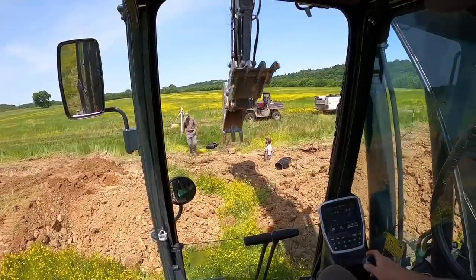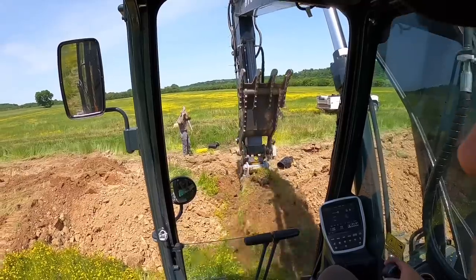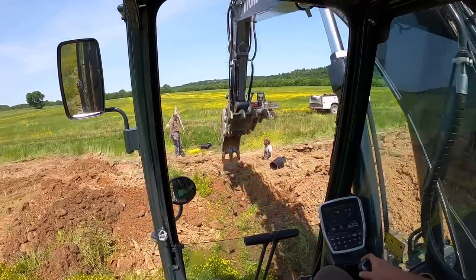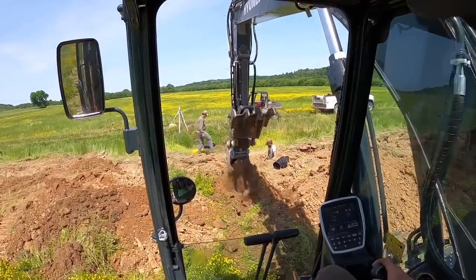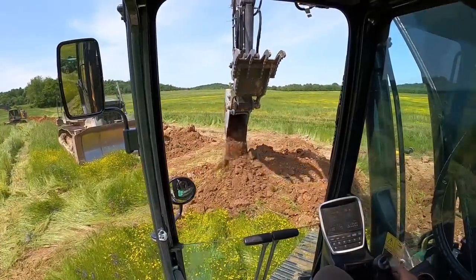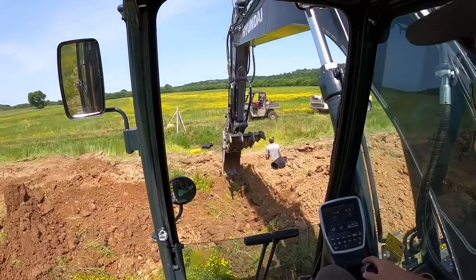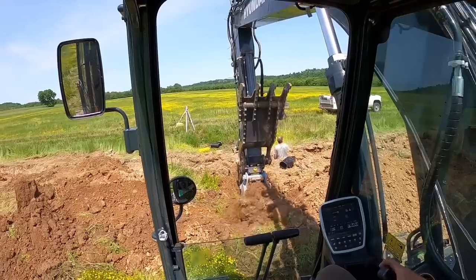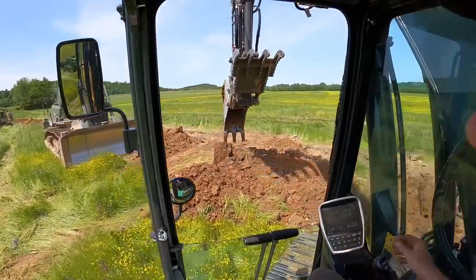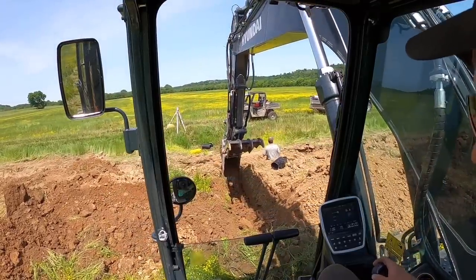We are officially done digging the mainline. I'm a little bit sad because I don't get to play on the new excavator anymore, but I'm ready to get some footage in the ground and switch back over to the plow. This has been a good reminder of how we did it old school. The plow is definitely faster — if we're 4 feet deep or less, what we can do in about 15 minutes would take us about 4 hours before. A lot of you guys have been asking how far the laser will reach. We feel pretty comfortable reaching out about 3,000 feet, and after that we usually take the time to move it.